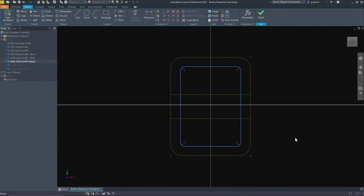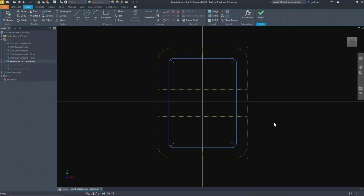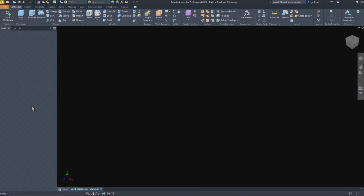Here's one that I did for layout, and you'll see two lines on this. This is where your latch will actually break. So depending on if you're doing a lift-off handle or a lift lid, this will be the alignment of where that would be, and this blue would actually be what's cut out of the wood. The rest just shows your boundary so you can align it right so it's not having a collision problem. All these are already prepped. Here's the other thing I actually did.